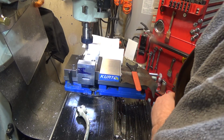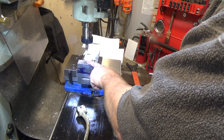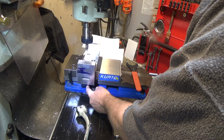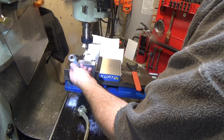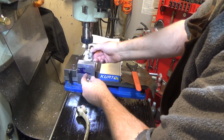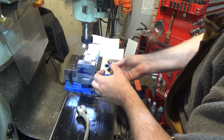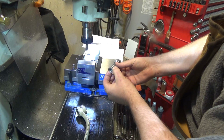Next up, we're just going to start with a pretty straightforward operation. I'm going to drill a hole 1/64 under 1/2 inch, ream 1/2 inch all the way through this whole part, which is kind of deep. Ultimately, that is what's going to hold this guy in place. You'll notice the D shape of this guy. It's 0.875 there, 0.75 there roughly. This was probably for a wrench hold.